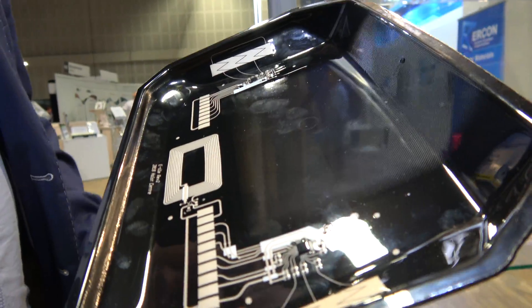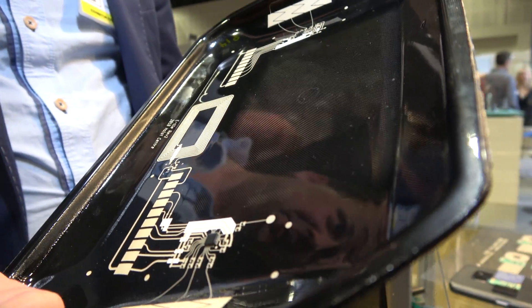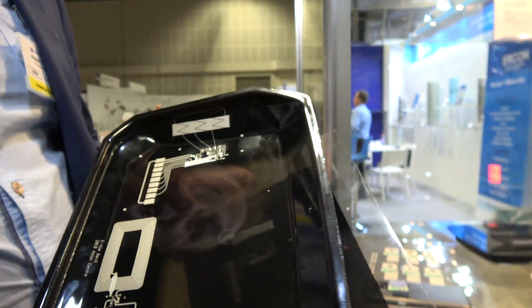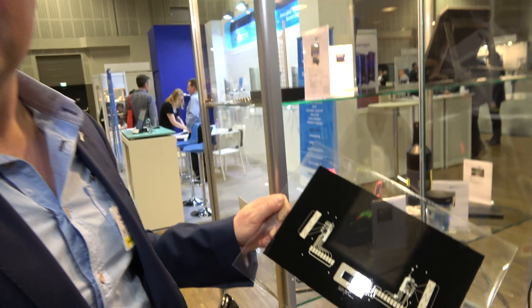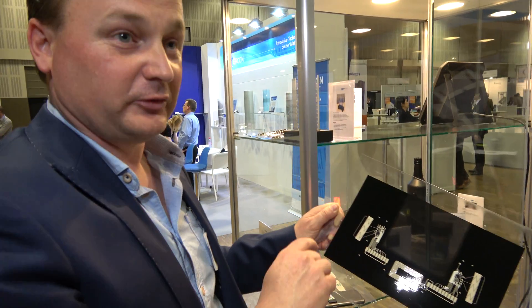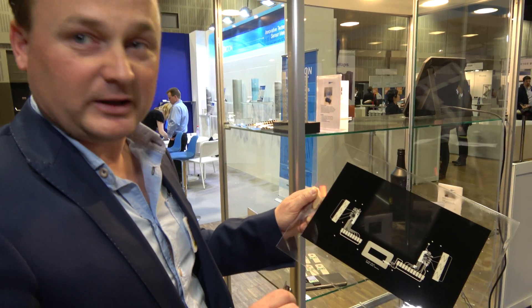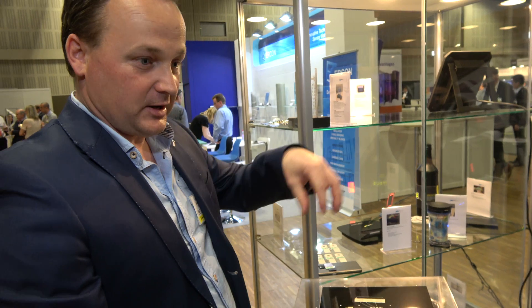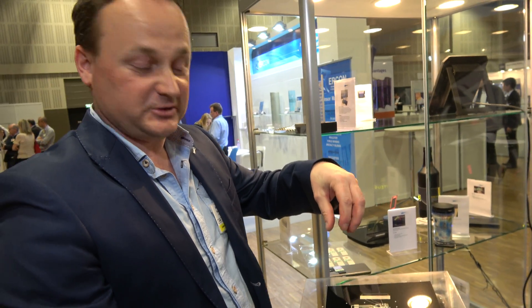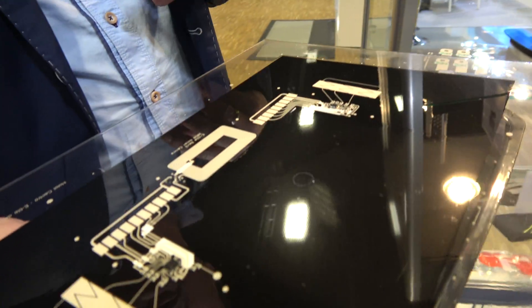How do you put the chipset right there? The chips are placed by a pick-and-place machine — very accurate. First you do a stencil printing of the conductive adhesive, so you have all the small contact pads that are really accurately stencil printed. And then the pick-and-place machine takes from a wafer stage, takes a component, measures the orientation, looks for the position, and then places it in the isotropic conductivity.